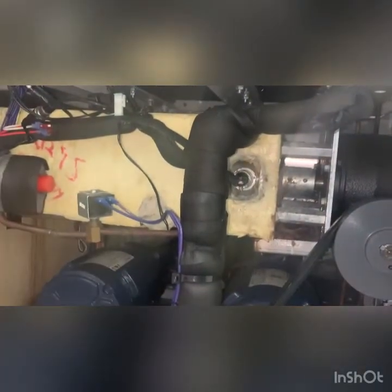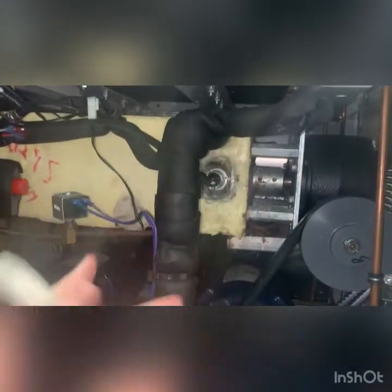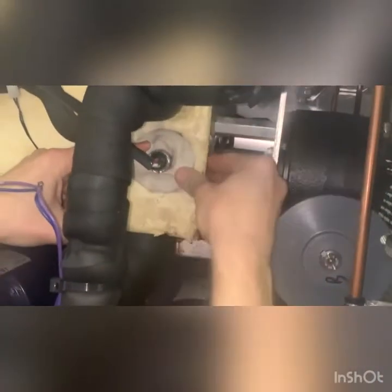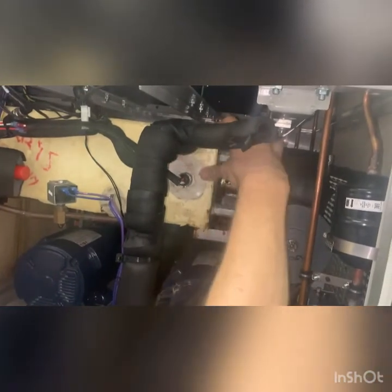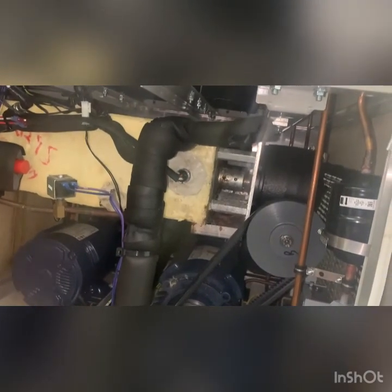They gave us a block of insulated sealant. What I found easiest is — this is my kindergarten project — we'll take it and wrap it around there. The idea is obviously that the barrel is like zero to six degrees, and you saw the exposed metal — we don't want it fighting with the heat that's in this cabinet. First shot, no leaking. Duke pressure sensor change — appreciate it.